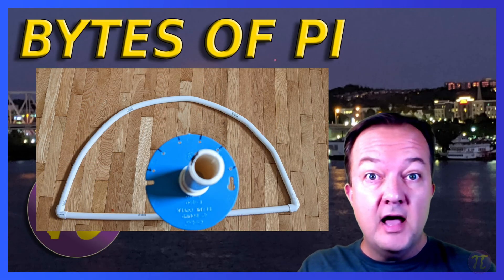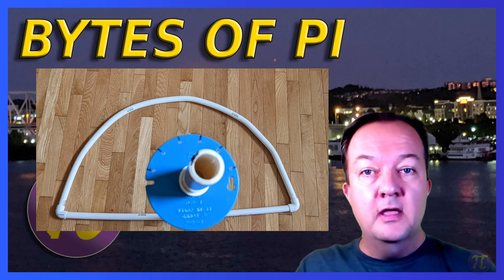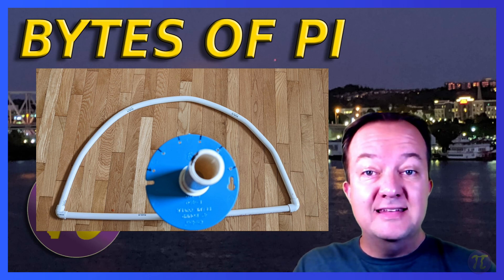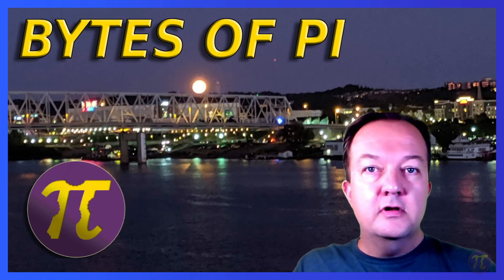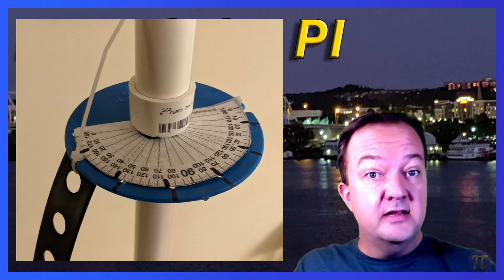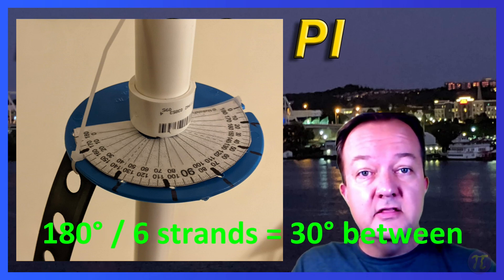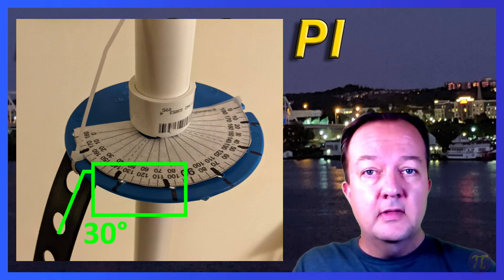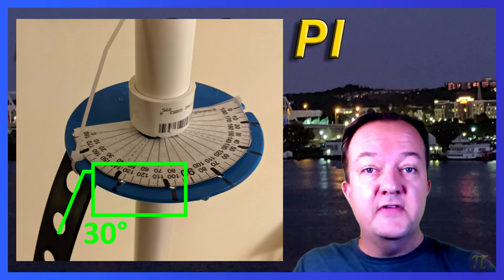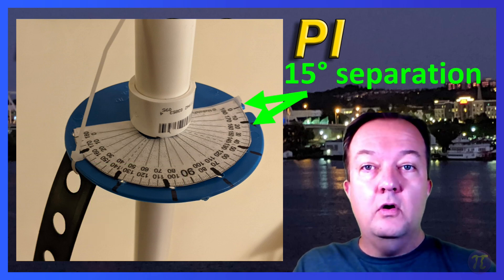Once the frame was assembled, we created the top held together by two PVC caps and a 4-inch PVC round blank with a 3¼-inch metal octagon blank below it. I also found at Home Depot a thicker, more durable external round blank that didn't require the metal octagon for support. In order to line up the holes I printed a paper protractor the size of the blanks. There are six connecting points, so 180 degrees divided by six is 30 degrees — meaning I needed to space the holes every 30 degrees. However, we want the first and last strands not facing perpendicular from the audience, so we start at 15 degrees and then drill a hole every 30 degrees.